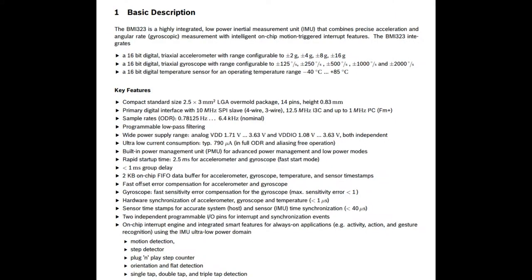A lot of other details. The accelerometer is pretty standard — it goes plus or minus 2, 4, 8, 16G. The gyroscope goes plus or minus 125 up to 2,000 degrees per second. There's also an onboard digital temperature sensor, which you can use as part of your temperature compensation management — sometimes the sensors do drift with temperature. It's basically an all-in-one little ready-to-go fusion chip.